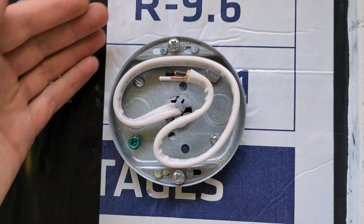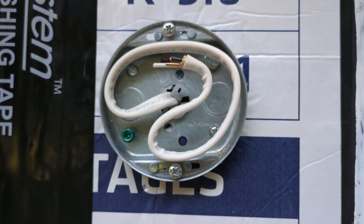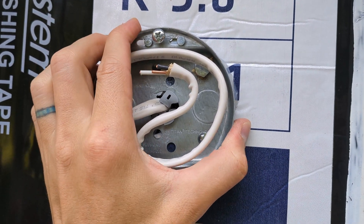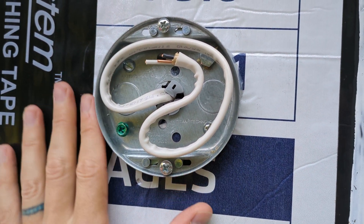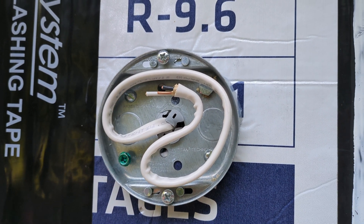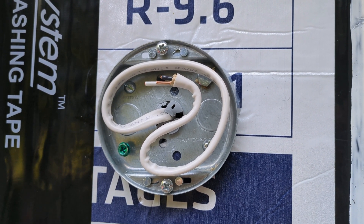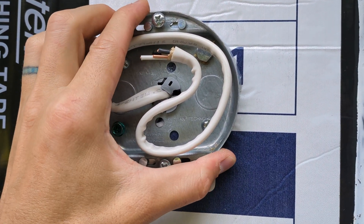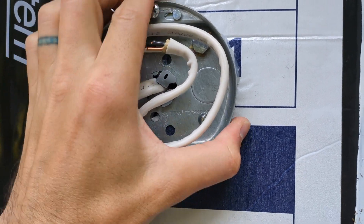I'm going to install wood siding — it's going to be cut to go right up against this — then the light fixture goes on top. I was concerned about how sturdy this would be for hanging a light fixture with the foam in between. I ended up going with three about three-inch long bolts with washers and nuts on the opposite side. With just two bolts it's a little wobbly, but with three it's really secure.